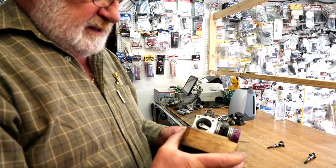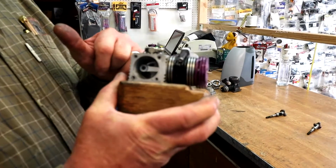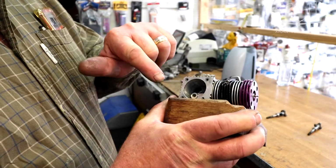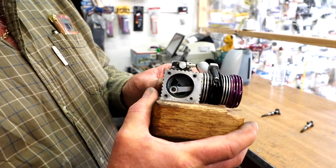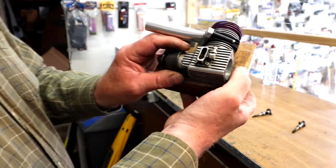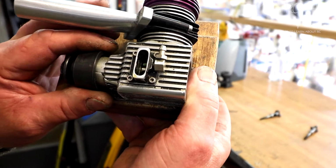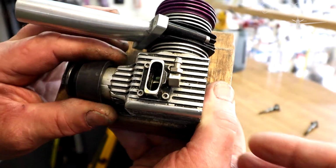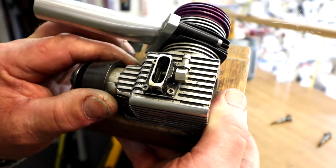I don't know if you're able to see this, but we'll give it a go. Now, this has got an 8 mil diameter shaft, but a 30mm diameter induction port. So if you look down there, can you see down the hole? Probably wouldn't see down the hole with the camera. If you turn it a bit more there, yeah, you can see that. See, the port's opening up.